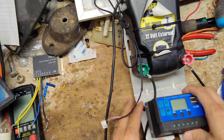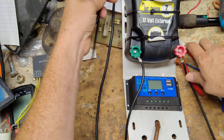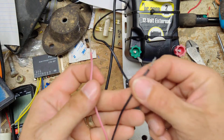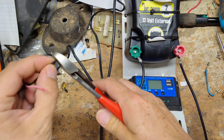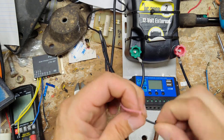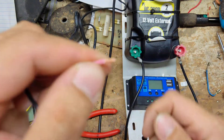So what I need to figure out is I'm going to put this regulator somewhere in that range here. I need to make sure that these wires are going to be long enough, which they are if I cut the cable tie off. So we've got a plus and a minus, red and black. I'm going to cut this back and get some fresh wire — it's a bit corroded looking. We're going to strip this back, and we don't need that much wire exposed, just about that much.